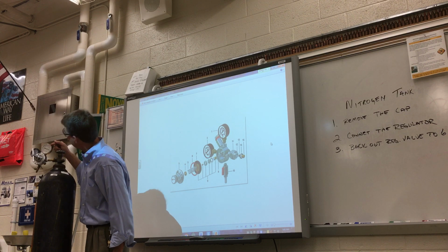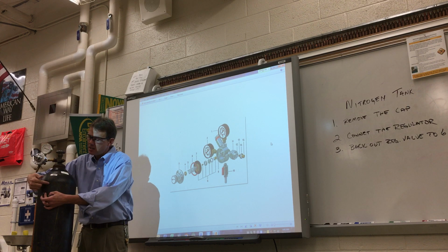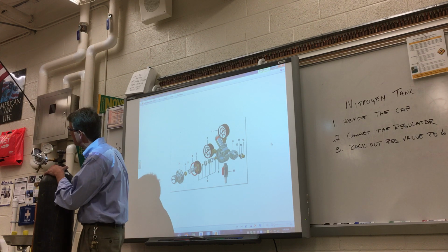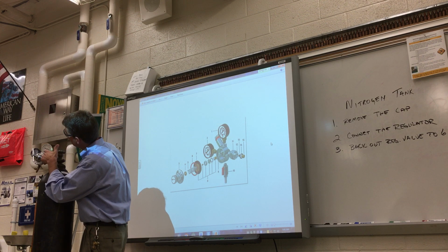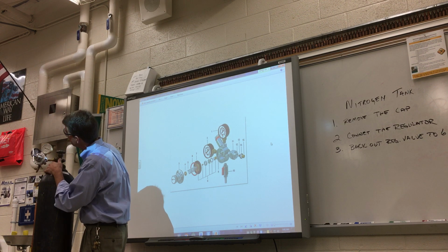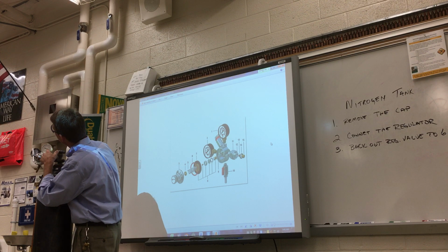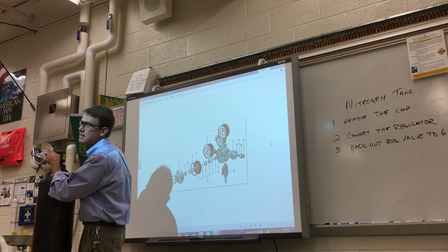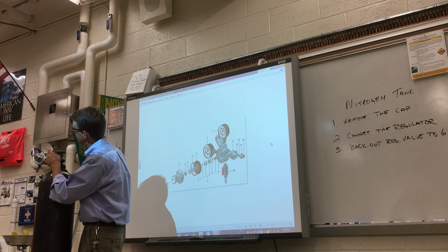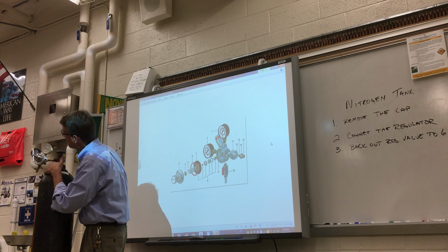And when I open up the main valve, look at that, 2,500 pounds of pressure per square inch. Every inch that you see has got about 2,500 pounds of pressure behind it. Now on this gauge, there are 3 different sets of readings. The outermost reading is one measurement, the innermost in the middle was red, and that's another measurement. We're looking all the way into the center for us. That's PSI. So when I look all the way to the center, the needle's pointing to 2,500. Over here, my working pressure, that's 0.